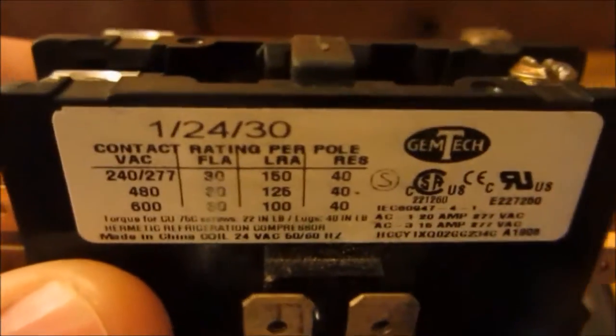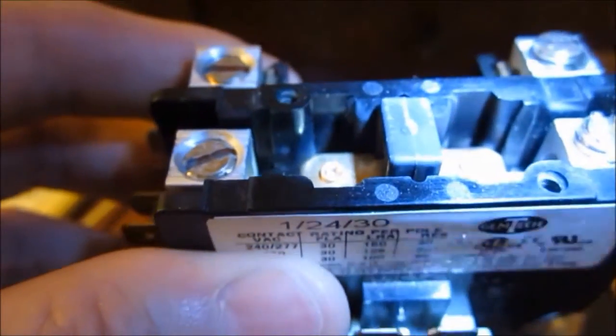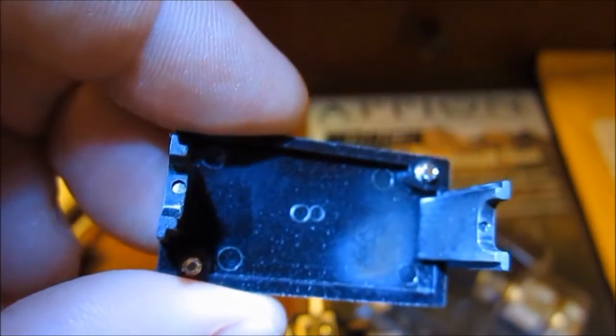Got some liquid back to my scroll — old Copeland's got a little bit of frost on him, that's not good. Yeah, it was stuck. I kind of pried on it a little bit and it opened up. Here's a closer look at the old contactor that stuck on me. You can kind of see — get some light on it — it's kind of smoked in there around the contacts from the arcing and sparking from starting and stopping so many times. And here's that little cover, right over the side that stuck — a little smoke spot.